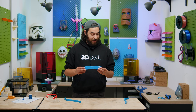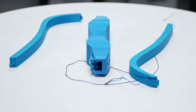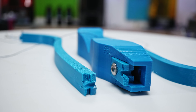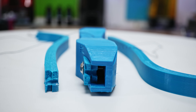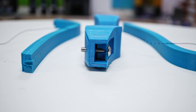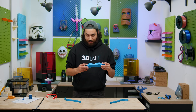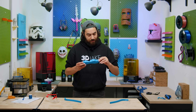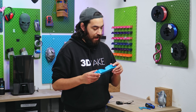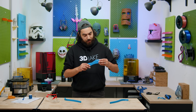We got between nine and ten kilos, and the riser itself is totally undamaged. But the limbs did not fare well. I used tons of perimeters so all the layer lines go in the same direction — technically zero infill but also kind of 100% filled. It broke right at the screws, as I thought it would. I'll have to change that and also fully enclose the limbs in the riser so there are no fiddly parts. Nine to ten kilos wasn't bad though.